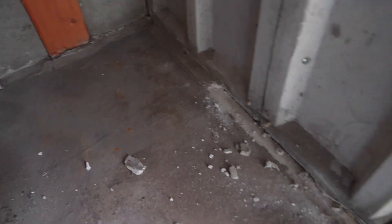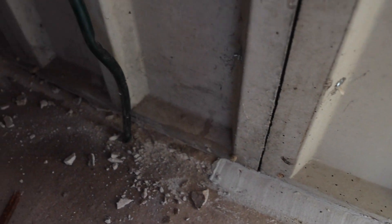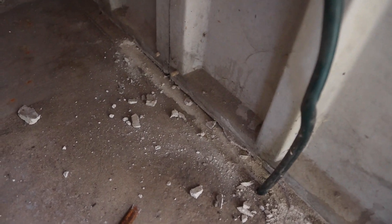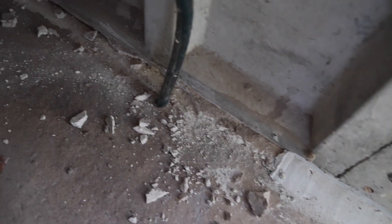When they build a garage, what they tend to do is put a bit of cement at the bottom all the way around. They did make a poor attempt at doing so when they built this garage in the first place. I've pulled a lot of it out, but this is the original — there's maybe a centimetre, if that, possibly even half that, of cement coverage going around, which isn't good enough. So I'm going to put a new amount of cement around here to prevent weather getting in.